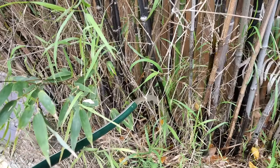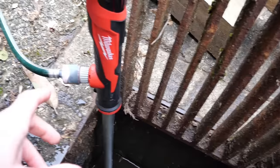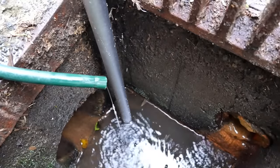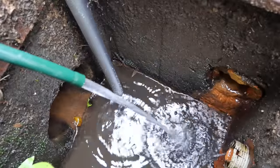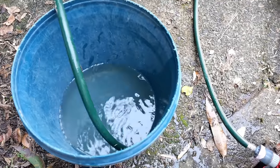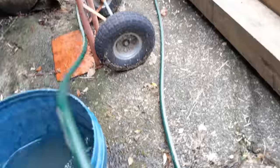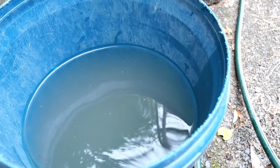Water that we've used can be used to water the garden and the weeds, so that's quite cool. Empty 20 litre Bunnings bucket — let's see how long it takes to fill. Now this is one of the worst case scenarios because we're going through 15mm hose, not 19mm, and it's 10 metres long, so we're not going to get the maximum number. Timer is going, bucket is filling. Alright, so that's a minute — and as we can see we're about three quarters of that bucket, about 15 litres. So that is a significant drop, about 20 litres per minute.